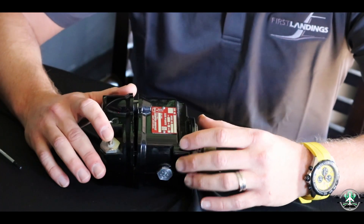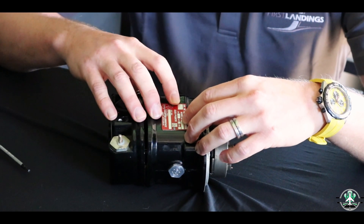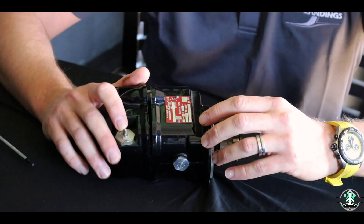It generates its own electricity, converts that into high voltage, sends it to the spark plug, and at the right time causes a spark. The other key part on the outside is this stud — this is where the p-lead connects. When you do your mag check on the run-up and turn that switch to off, you are grounding this lead, which shuts the magneto off. When it's grounded it's dead — it won't produce the energy needed to cause a spark. That's why you must always assume the prop is live, because any issue with that p-lead means a potentially live magneto.